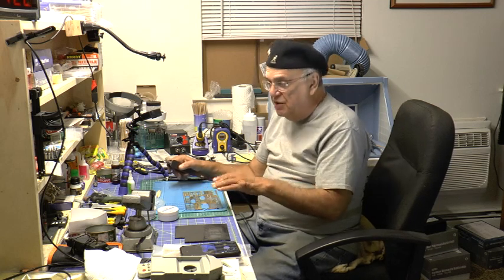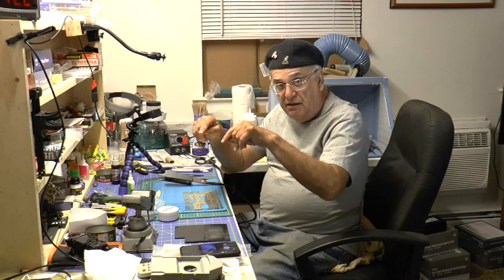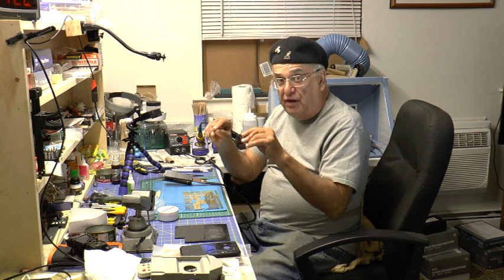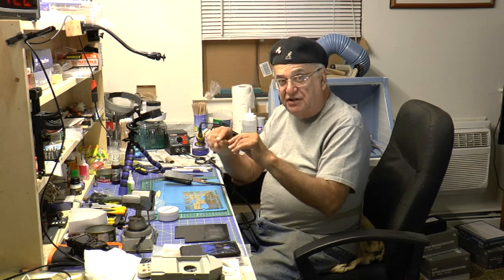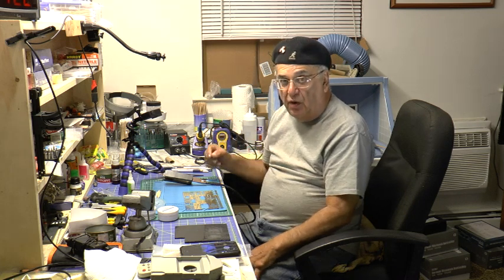It's local. So those three little gussets that you were working on tonight, Ron, you could put all three of those on. Now, when it came to the railing that you're going to do around that little platform, you could tack it all on, and then if you want to put a little CA on it, you can, just to reinforce it. But basically, if you solder it, it's going to be there for a long while.